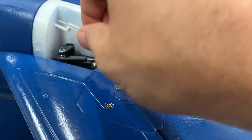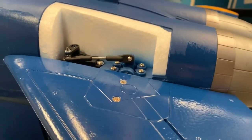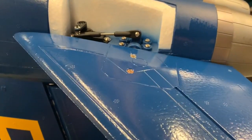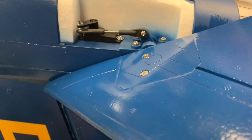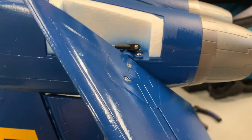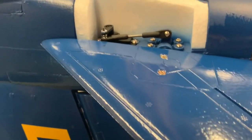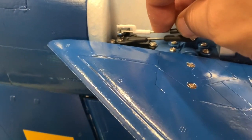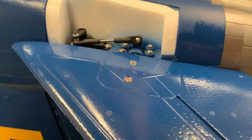The action of this arm as it moves forward will cause it to go down and up. As you move the arm to the rear, it drops down a little bit, rises up, then drops down as you go forward — right there it's at its highest point, and there it's at its lowest point. So as you move it forward and backwards, the arm will flex. If the rod were inserted there, that creates a binding action that causes the rod to bend and place torsional stress on the servo arm. What we're trying to do is eliminate that.